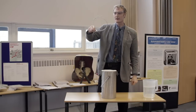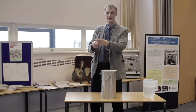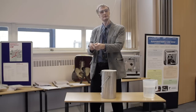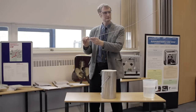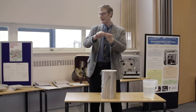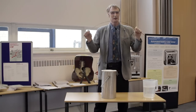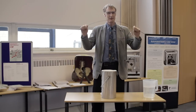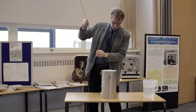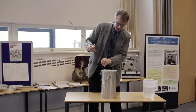We're going to speed the film up, otherwise you're going to get a bit bored. Fantastic — look at that. So remember, when it's in its high temperature phase, I can push it into its low temperature phase by applying some stress; that's called super elasticity. Or I can drop it into a low temperature environment, like this liquid nitrogen — I can drop it below its transition temperature.